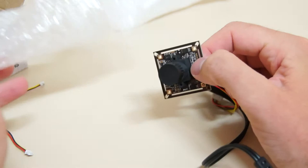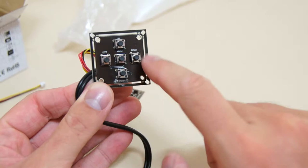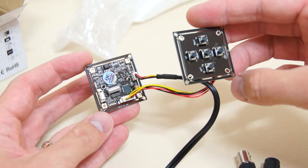By using this OSD you can change all the settings in the camera as described in the manual. It has left, right, up, down, and select controls. Basically what you do is plug the OSD in, adjust whatever you need to adjust, and then remove it. You will not have this flying in your RC plane or quadcopter — it's just extra weight and doesn't make sense. You only need the camera itself, and as you can see it looks nice.